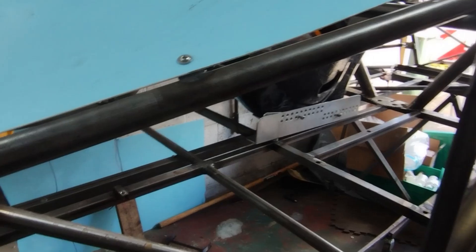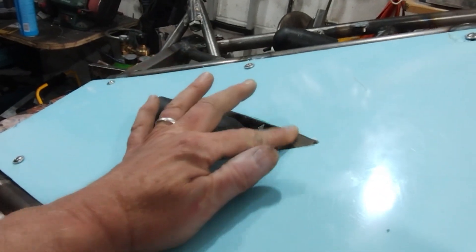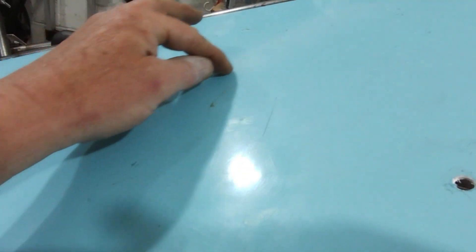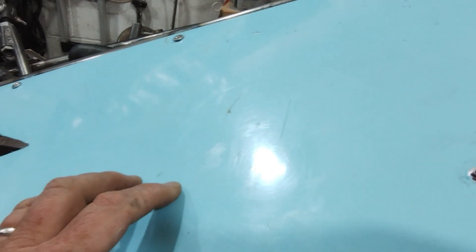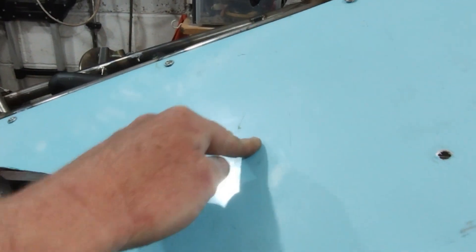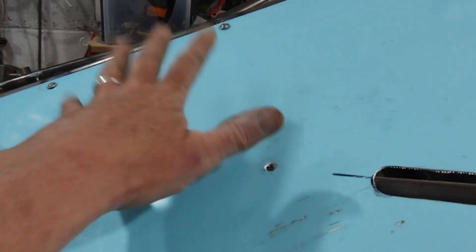So as I was talking about before, I have a little bit of stiffening GRP on the back. I'm not sure if it's going to be enough or if I need more, but when the bubble bit is added, and also around this area somewhere because the fuel tank will be underneath — so around this area somewhere there will be the filler cap — I'll probably put a carbon-look ring around it, partly to look a bit flash but also I'm not too sure about fuel spills on wrap, whether they go together that well. I can see it's still moving a bit, but it's fairly stiff. These aren't fully tight. So I'm not going to do any more stiffening yet, because with those bits added that might be enough. I've also got to put that welding nut on, and obviously I'll do the other side at some point — it's just going to be a mirror thing.